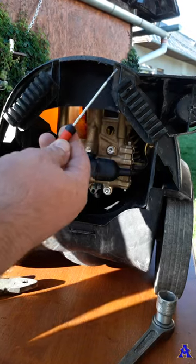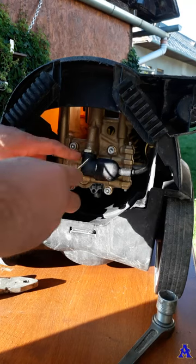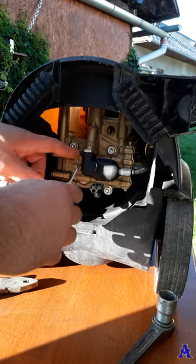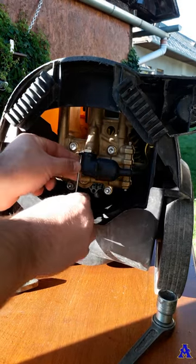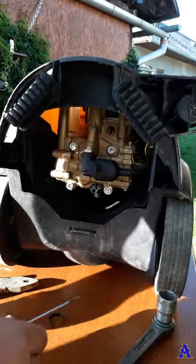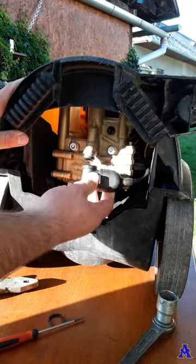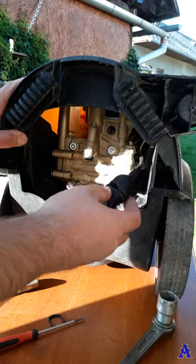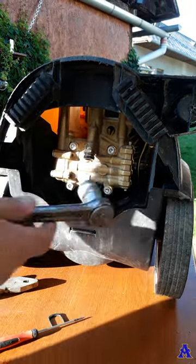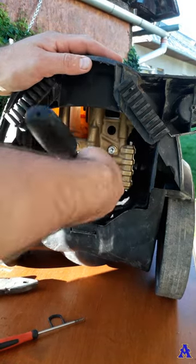And what you have to do, you have to take the thin flat screwdriver and there is a plastic U-pin that holds the cable going from micro switch to control piston set or start-stop valve. So you have to take it out like this. It goes easy and pull it out. Place it on the table, please. And now you can take off this part. As you can see, this is a cable that goes from micro switch. And now what you have to do is take the reversible ratchet and number 21 and release the screw.